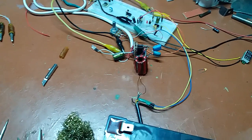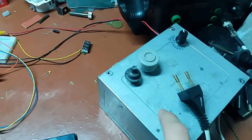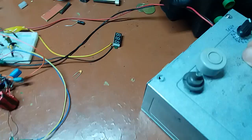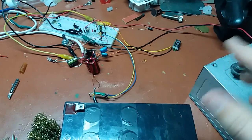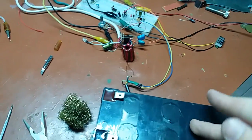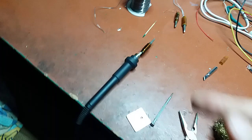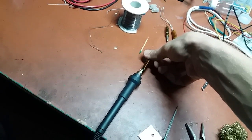The circuit is in prototyping stage so I'm not going to show any schematics yet. The power supply is set to about 16 volts, with a current limit of 9 amps. The circuit consumes a maximum of about 4 amps from a cold start, which equals about 60 watts maximum. And they say the thing will heat up within 15 seconds — hot enough to melt solder.